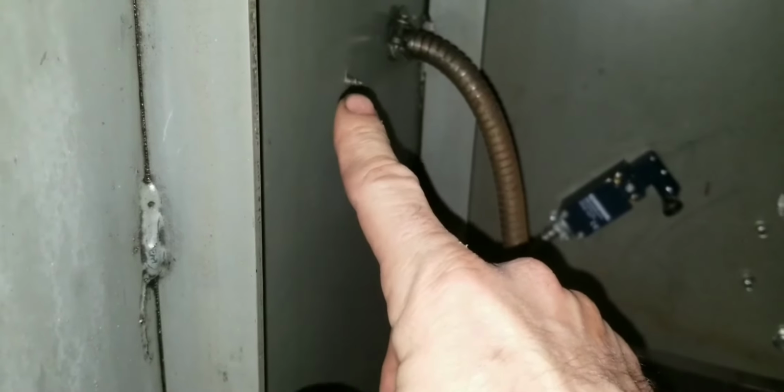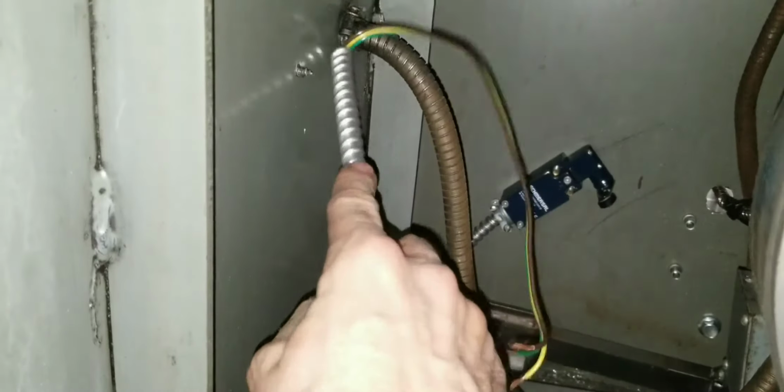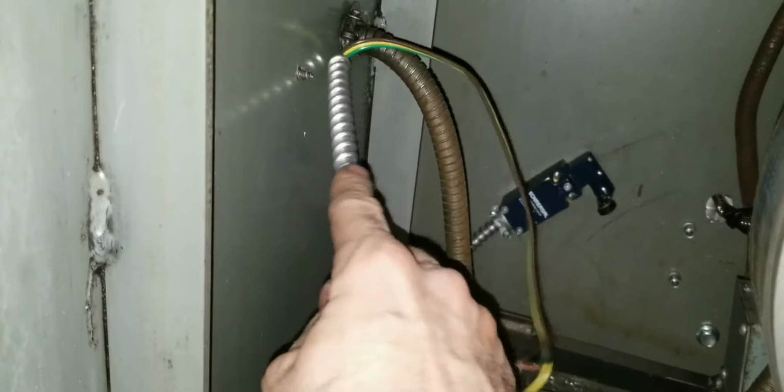My switch here. Well, here's the conduit. If you notice the other piece of conduit in here, right there, there's a punch out in the back of the furnace box. So I've got to take the box off, not punch that out, drill a hole there. And then this will run through in there right beside the other one.